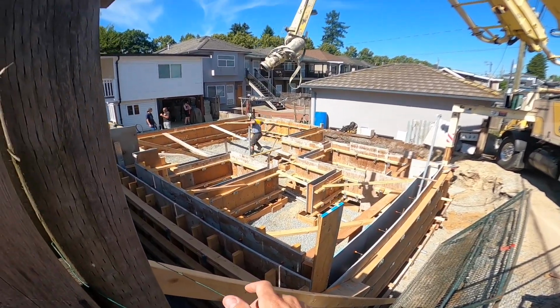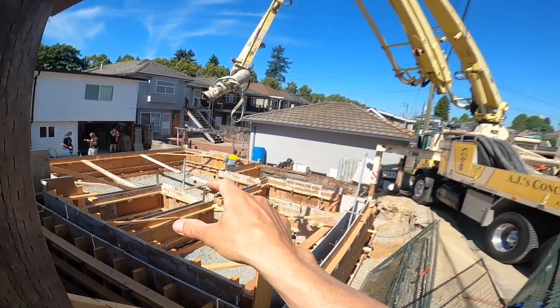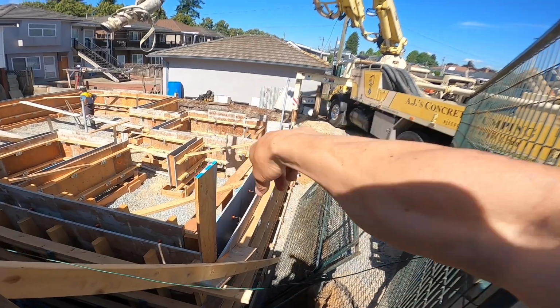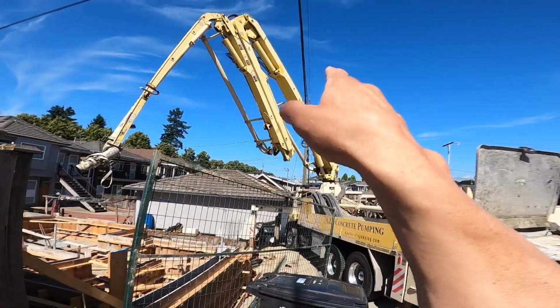The reason this is better, if we were to go down to a 3-inch hose, now we've got a 36-inch 4-to-3 reducer, plus a 10-foot 3-inch whip. We can only get that boom up so high, and your hose is still dragging into the pour area, right? And no, I'm not closer than 3 feet to those wires. It's just a goofy angle.